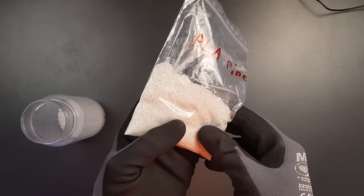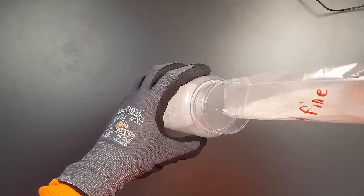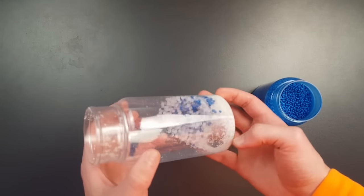I also had shredded PLA granules from my last video — recycled 3D printing waste — and I wondered what would happen mixing those PLA granules with soft TPU pellets. I added some blue PLA to give it color. I know some plastics bond molecularly when melted and some don't — PLA printed on top of TPU is known to delaminate — but what if both melt together and get mechanically mixed by the extruder screw? Maybe the mixing process gives good layer adhesion and interesting properties. Let's find out.